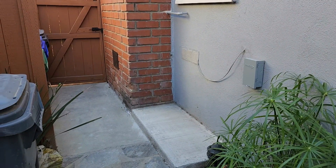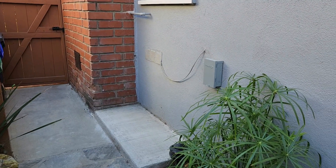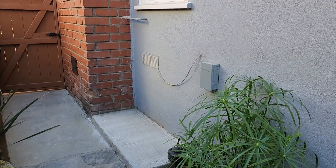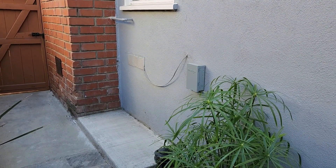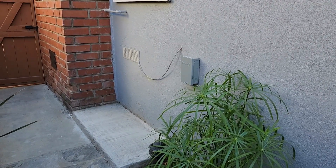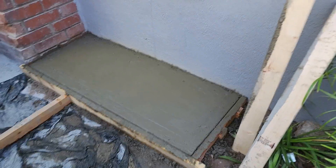We don't use this side yard really for anything other than a passageway from the front to the back. We're going to locate the outdoor unit for the front indoor units right here in this little alcove formed by the fireplace chimney. You can see there's quite a height distance between the grade and the bottom of the window, so we'll be able to fit one of the larger units that goes up to 52 inches and still stay below the window.